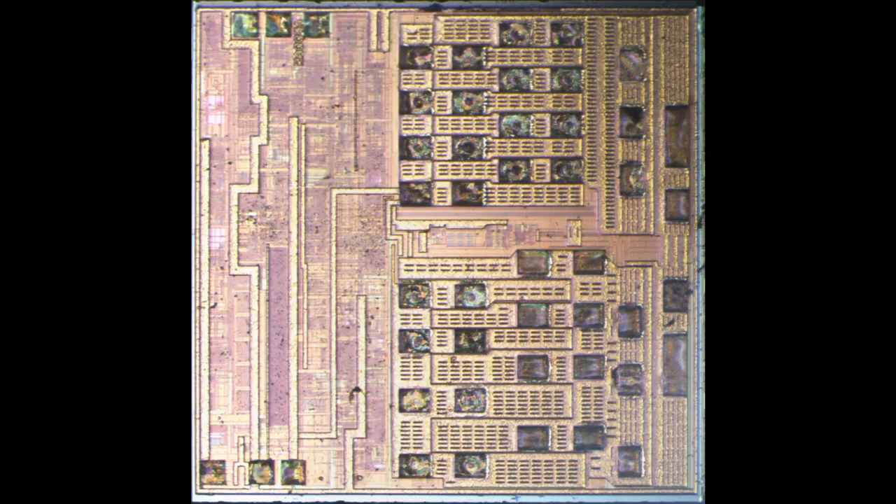Last part: the power management integrated controller, sometimes called a voltage regulator. These days they're getting so complicated they provide more than just voltage regulation, although on the Raspberry Pi Pico W it's mostly just a dual output regulator. Control is on this side, analog in nature, and then two transistor structures here — they're pass transistors of some sort. The reason there are two is it's a dual output assembly, although to increase current carrying capability these are actually just bonded together in the die. A really classic power supply circuit.